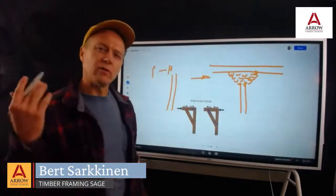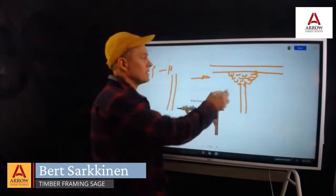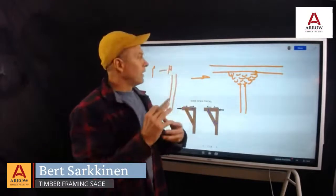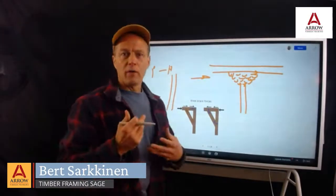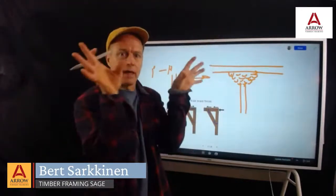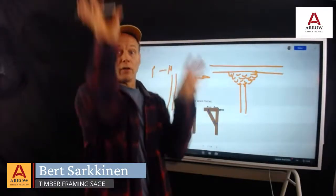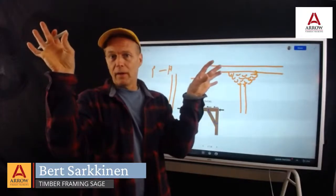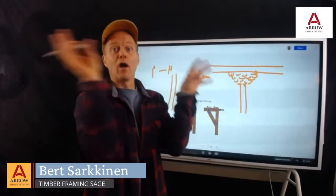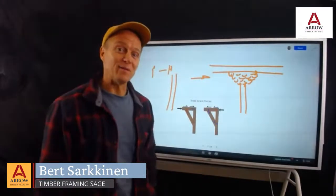My mind struggled with it. Finally, it dawned on me that all of these pieces, with friction, all interlocking, and they go 90 on each other, create what you might call a flexible or adjustable knee brace. They all interlock and stack together, so they're all tight, they're not going to shift real easy. But then the earthquake comes along and it does this up and down thing you're talking about. And when it's gone, it settles back in and it's locked back together. So kind of crazy, crazy cool, right?